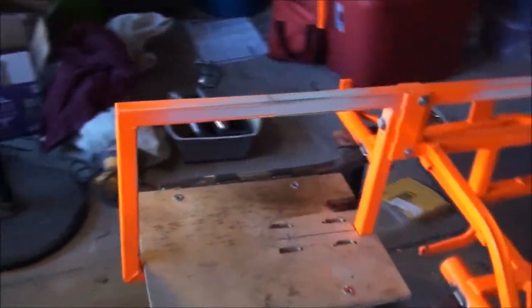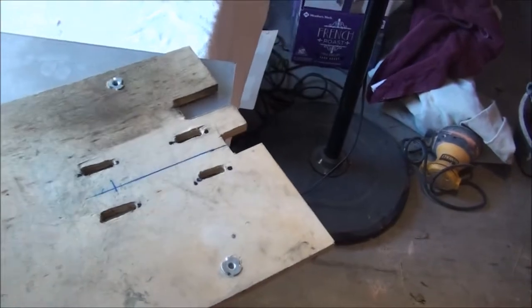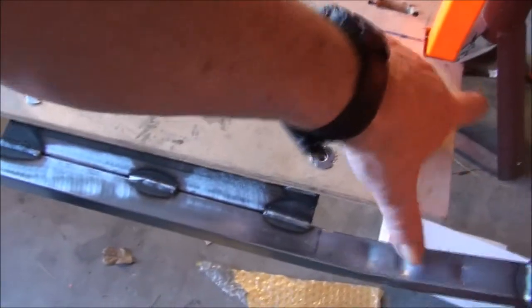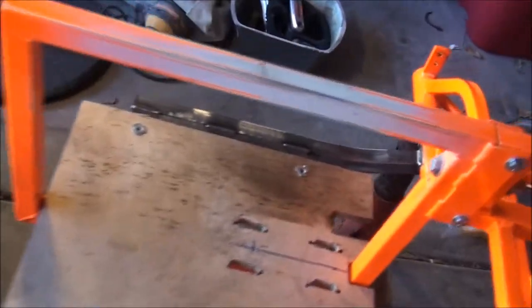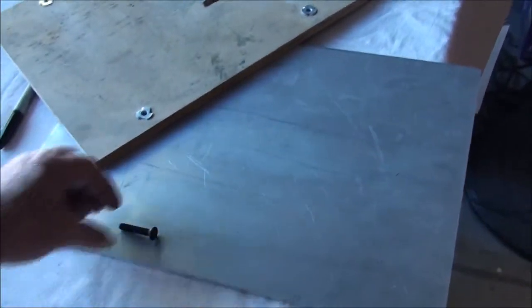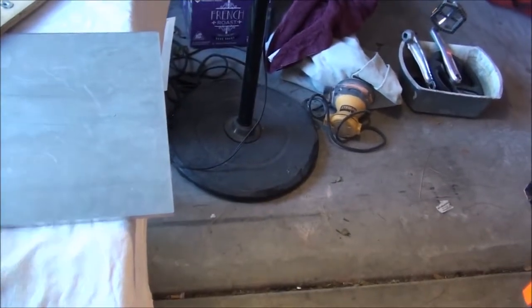Well viewers, I just got back from the welder - it's all been welded up, looks good. We're gonna get ready to do our motor plate. You can see this aluminum plate is longer, and we're gonna have to notch it in the front and the back on center line so it fits in flush on both sides and is exactly the same width. We'll put in our motor slots, notch each side, drill the holes for the mounting bolts, and use flush mount allen key bolts - there's gonna be seven of them. We're also gonna put some weather stripping in between to keep the noise level down.